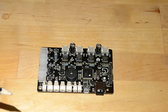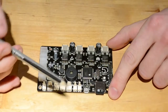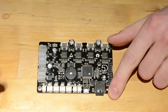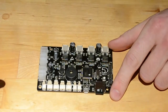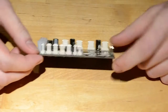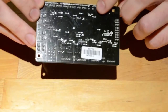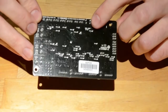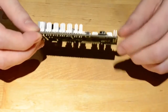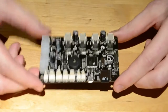The first features I'll address are two of the biggest flaws with the printer board. The first is the fact that with the printer board it was remarkably easy to tear off the USB port — obviously a bit of a problem when that's the main means of communication with the board. For this redesign we're still using a micro USB connector, but we're now using one that has through-hole mechanical retaining tabs. This gives it much more mechanical strength, so you'd really have to make a conscious effort to rip it off.